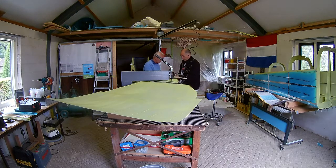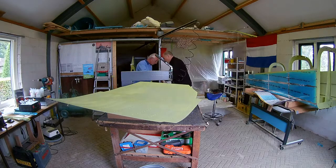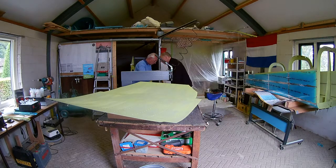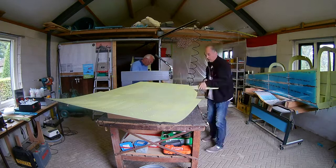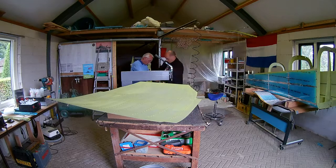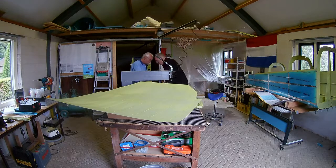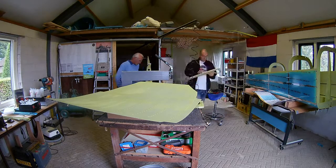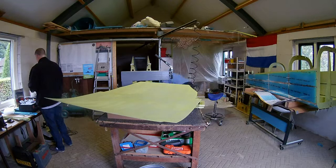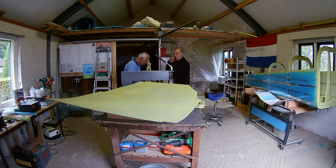There I actually made a mistake. We were inserting the nut plates on the ribs, and while we were doing that I thought, hey, maybe it's easy to also attach the ten nut plates that need to be attached to the baggage seat side. Which wasn't very smart, because actually there is another baggage floor panel that the nut plates should also go through. So the rivets which attach the nut plates go through the floor panel, then through the rib, and then to the nut plate — which, yeah, I've never seen that before until now. So I had to drill all those holes out in a later session when I figured out that it was wrong.